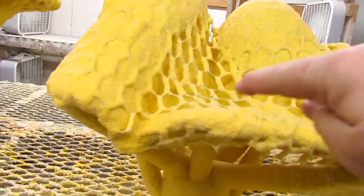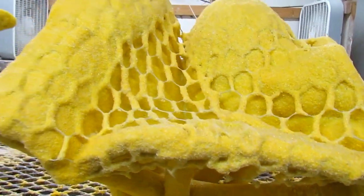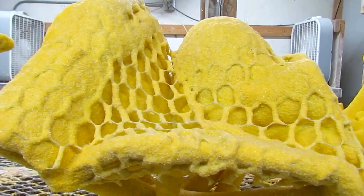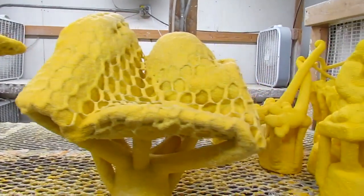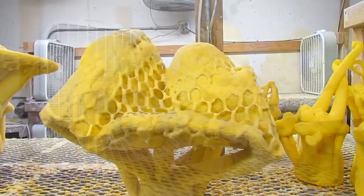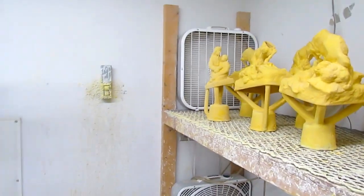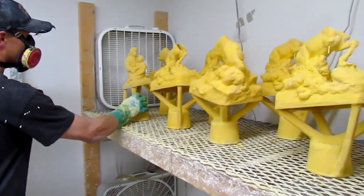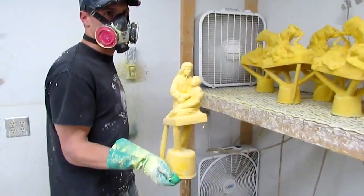And some of them, the bigger ones, they put chicken wire on just to give the ceramic mold a little more strength, because that bronze, when it goes in, is really heavy, and I've seen a mold break because of one little weakness in the mold. Now, he's going to do a process on one of these, so I'll just video that. This is not one of my pieces, it's somebody else's, but that's okay. It gives you an idea what's going on.